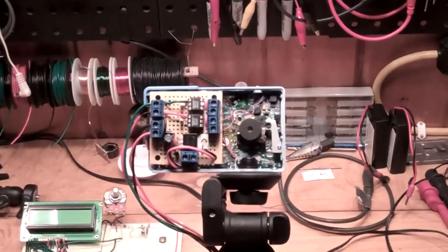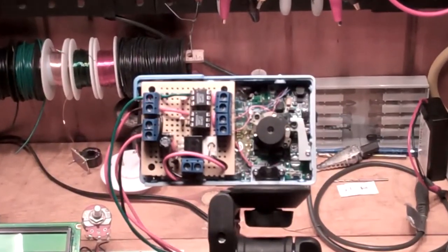Here's the circuit that I built to tie into the Arduino board. We're showing the line for the shutter going through an OptoMOS relay. So we run the two lines from the shutter into the relay and then one line to control the voltage to ground. So I'm showing how we also did the same thing with the power button there.